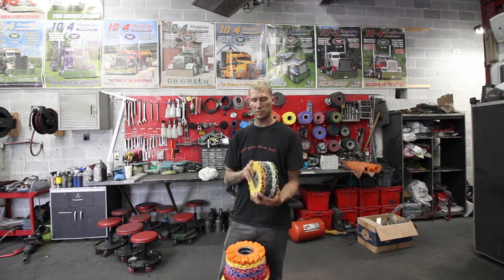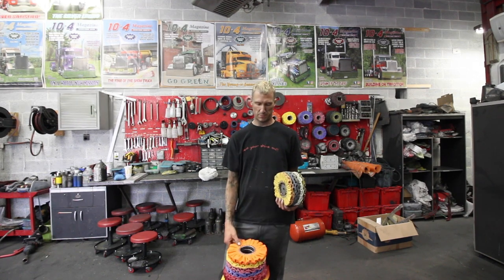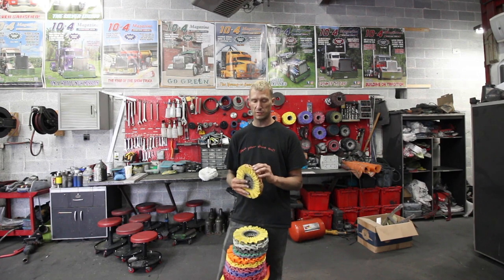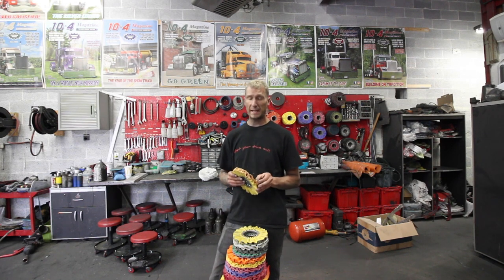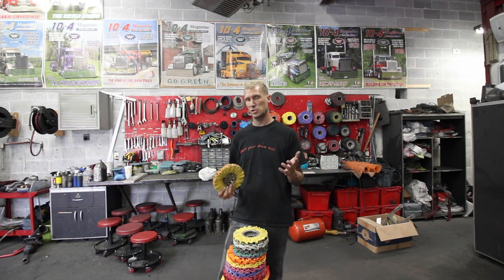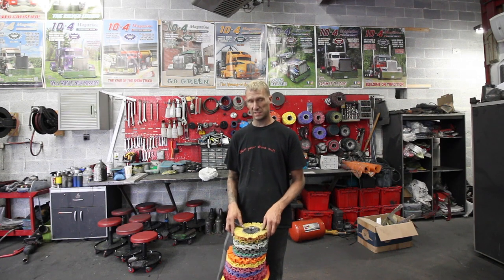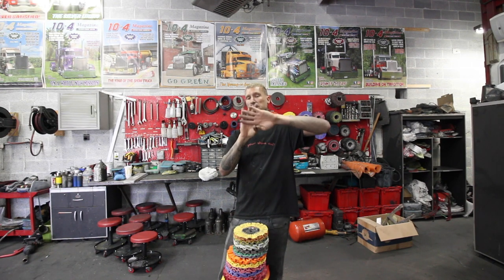Back to the buffs — the different colors. If you've watched my previous videos, you know I run just straight colors: straight orange, straight yellow, straight purple, straight green, straight pink, straight red. I don't use mixed colors. A lot of people do sell these fast cuts — yellow mixed with orange — very readily accessible in truck stops. I don't sell any of them here currently. I look at my buffs like sheets of sandpaper. Most fabrics are relatively the same — most buffs are made with 8680 fabric, meaning 86 strings going one way and 80 going the other, laying over each other in a fabric pattern. Most buffs you find in truck stops or on my website are all 8680 material. They're made that way because they hold compound and dissipate air, cooling off faster so they don't overheat.